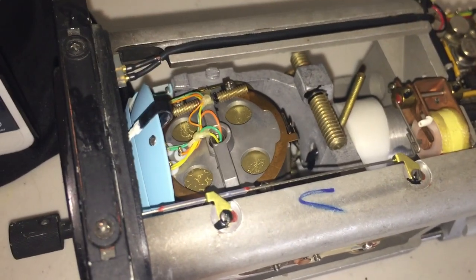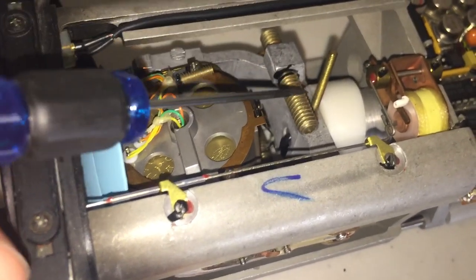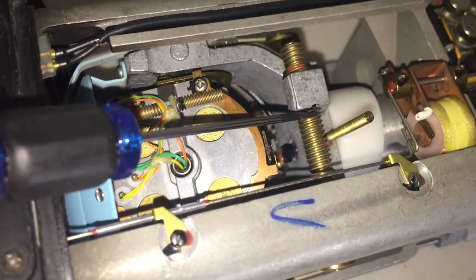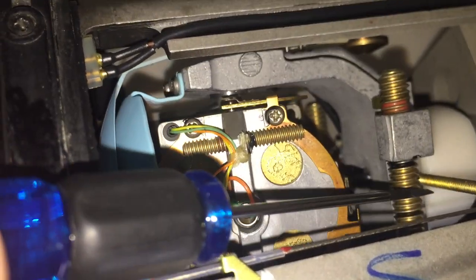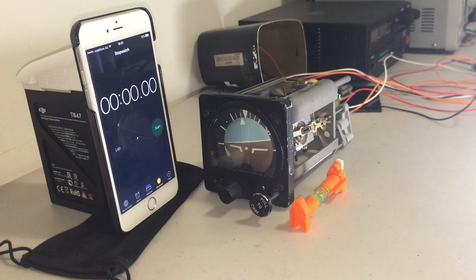One additional point I wanted to mention that I didn't mention yesterday: these brass threads are basically just to balance the instrument. You can see they have Loctite on them so they won't move. There's an alignment one there, and another one running fore and aft, again with Loctite. They are simply used to make sure the instrument is nicely balanced. I'm just about to start the gyro — I'll start the time-lapse on the Nikon camera first, so that's now recording one frame every two seconds.